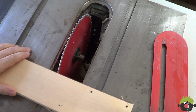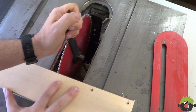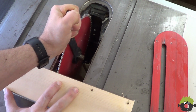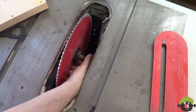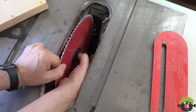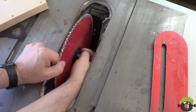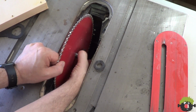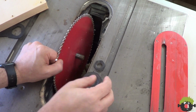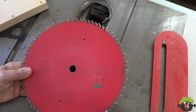I then have to dig around, find a scrap of wood to wedge the blade, because the arbor nut is reverse threaded and it's always a bear to crack loose. I also have to avoid dropping that nut into the belly of the beast, because if I do, it burrows itself into the pile of sawdust under the saw and cannot be reached from the top side. So it requires walking around to the back and digging through sawdust filled with wood splinters that can embed themselves under your fingernail if you're not careful. None of this has actually happened, mind you. It's just theoretically possible.